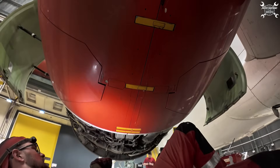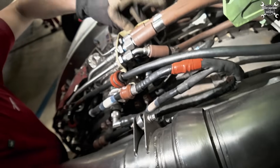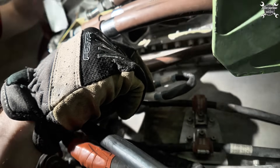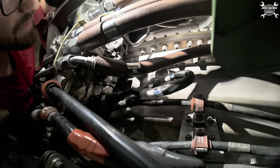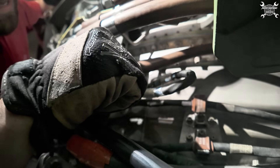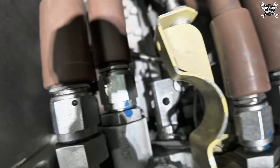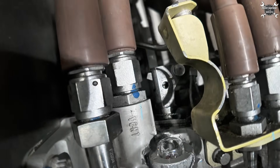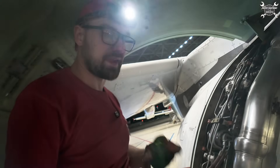Now let's reactivate the hydraulic control unit. To activate it again: lift the lever, pull the pin out, let it drop — and that's basically it. As I said, you don't need to be afraid that it will get stuck in the extended position — it is spring-loaded. It will always get back to the activate position. So it's a very easy solution, but it is important to use this flag so nobody will forget it in that position.